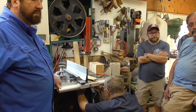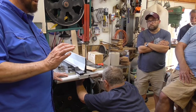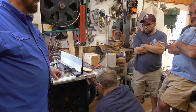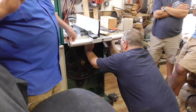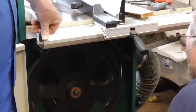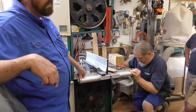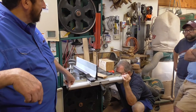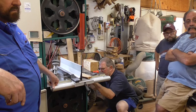I was cutting down some wood real hard on that table saw with the full kerf blade, going real slow, and it was still popping the breaker. So I'd have to cut it, recess, and cut it. It took a long time to cut through. I think I need to go with a really thin kerf blade when doing hard stuff. Check your wiring, check your hardware. Do you have an amp meter you can put on your motor? Check your amperage. You may have bad wiring running across the floor, and you may not have enough wire size to carry the load, warming those things up and popping the breaker. Look at the motor label and see what it says. Number 12 is good for 20 amps. Number 10 is good for 30.